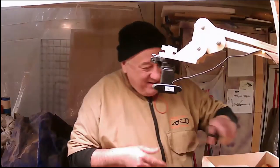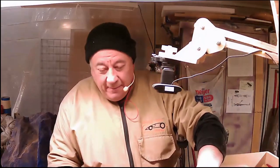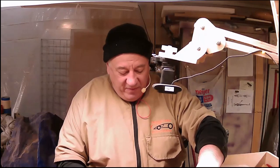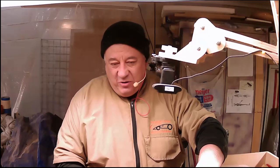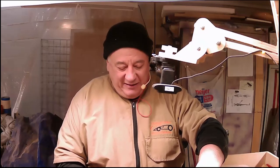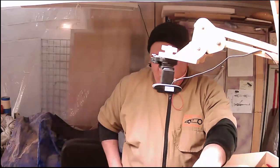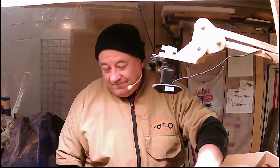The beauty of this is if you're unhappy you can scrape it out and start again. I left the stem on this one a little thicker than the last one and it seemed to work better. The hardest part about doing grooves, a barley twist, or a spiral in anything is getting the grooves laid out evenly. Once you've got them carved out a little bit, making them deeper or cleaning them up is just carving, which is not that hard compared to the laying out.